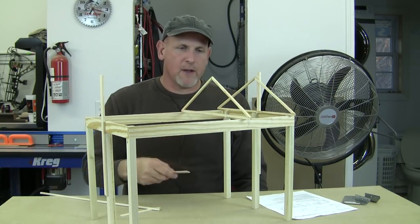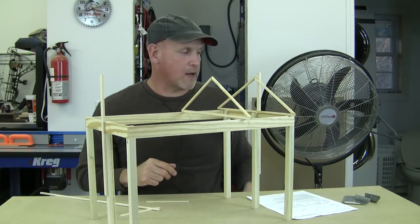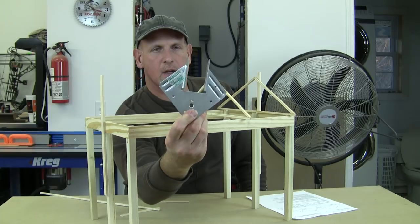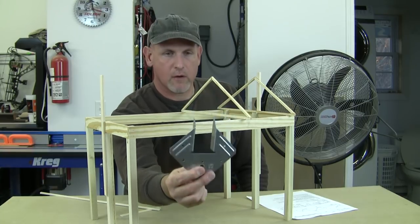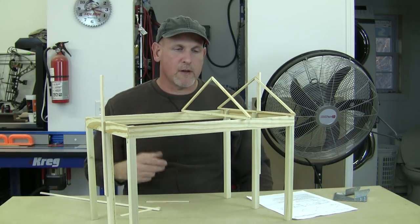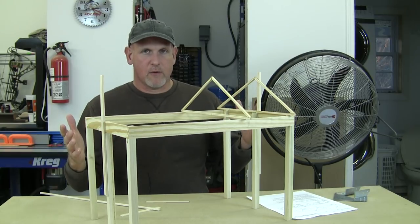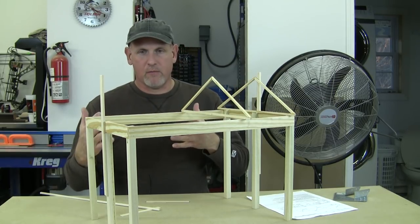We just continued on down until all these trusses were standing. Same procedure: lift it in, flip it, nail it, put purlins in. One thing I didn't do but you can do is put hurricane brackets on the end of the truss up on that band — it'll definitely keep that truss from wanting to lift up. I have some and may at some point go put them on just for good measure. By the time we had all these trusses up and had some purlins in them, the day was over. But at least I was at a place where I could come back on my own a day or two later and start putting the rest of the purlins in, and I knew they were reasonably secure — they weren't going to flop over or blow over or fall down.